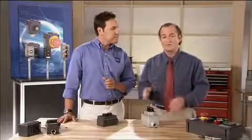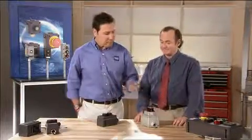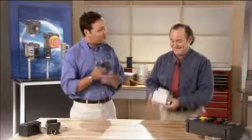That's right. But a lot of people haven't caught up with the times yet. Today, about 85% of classified areas are now Division 2. There have been huge technological advances on Division 2 products that are now available to designers and installers. But we still have a lot of folks using Division 1 rated equipment in Division 2 locations. I see. So, let's take a look at what you've got. All right. Well, you can hold on to this one. Okay. While I take the one from STAHL.